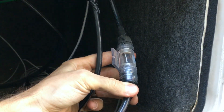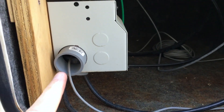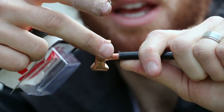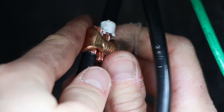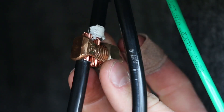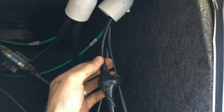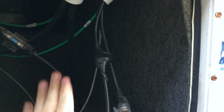Make sure you get a properly sized fuse on your positive wire. Both the negative and positive wires go to the solar charge controller. You'll notice a bulbous splicing joint here — that's because when I calculated my wire size, I didn't account for the extra length needed when routing real wire. Wire is never straight like a tape measure, so always add about 20% to your length calculation to avoid coming up short.